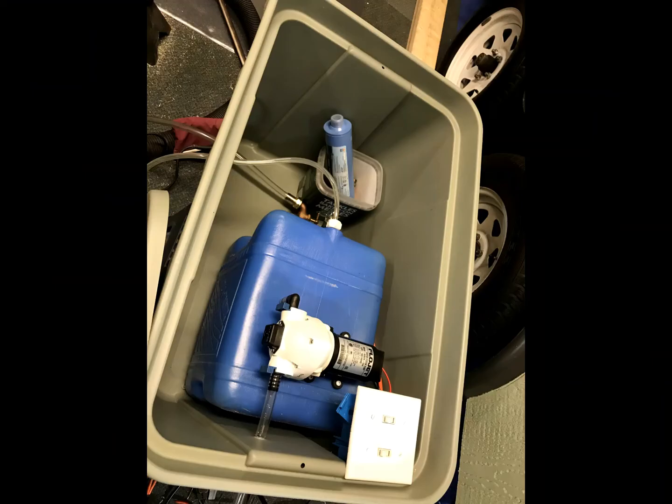I built a water heater out of a 5-gallon water tote by installing a 120-volt water heater element in series with a thermostat attached to the side of the tote. Yes, it does work, but you have to be careful and never let the water level go below the level of the element. With this restriction, we heat the water and then switch off the power.